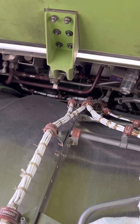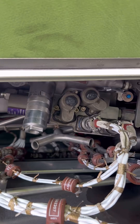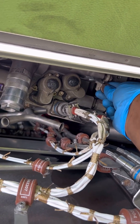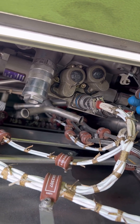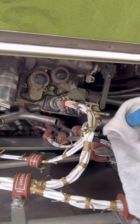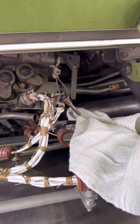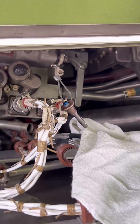At this point it's in an activated position, so now we need to deactivate it. The HCU is mounted on the pylon, right on top of the engine. We remove the pin from its storage position, then move the lever to the deactivated position, and then insert the pin to lock it out in the deactivated position.